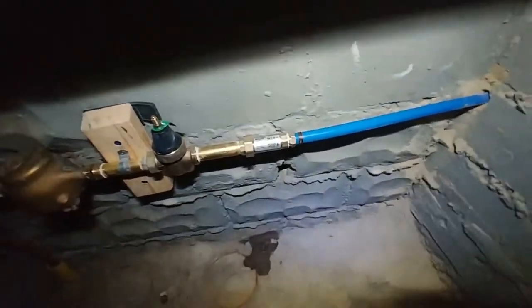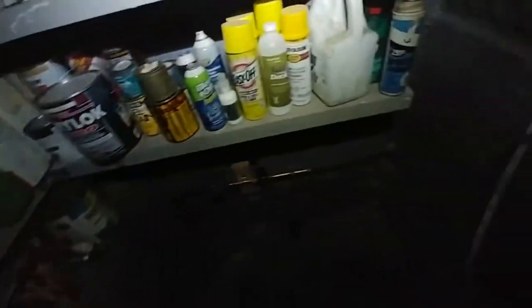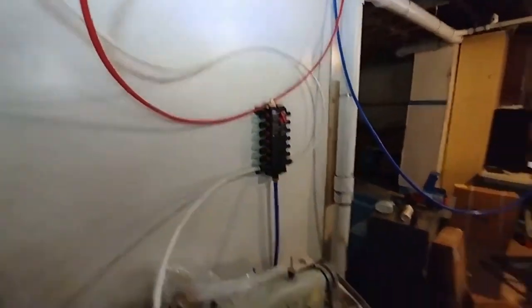And this is a super tiny dual check for your water supply, right to 3/4 and right to that manifold block. I might have considered just moving to the right and coming up here and putting that whole manifold block here, which is what he kind of had going on, ad hoc. But there isn't room without taking the shelves down, and then there isn't anywhere to go. That could be changed in the future to move all of this into that room. Given the lengths you've got here, it would be an easy change to make. For now, this was the clean area for it. We just got them hooked back up that night, and I haven't been back because it hasn't been time to charge this with water yet. So anyway, that's what's up with that.